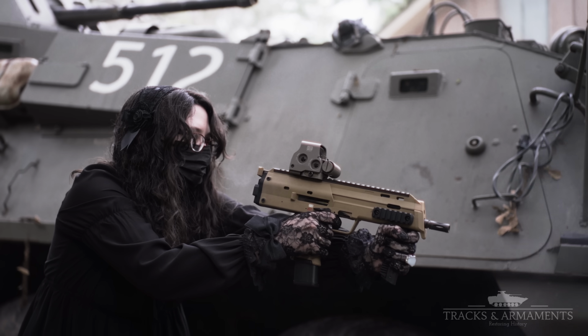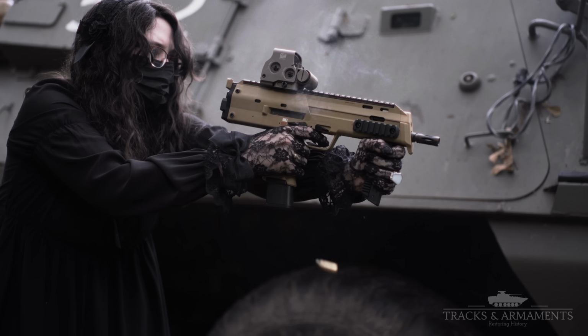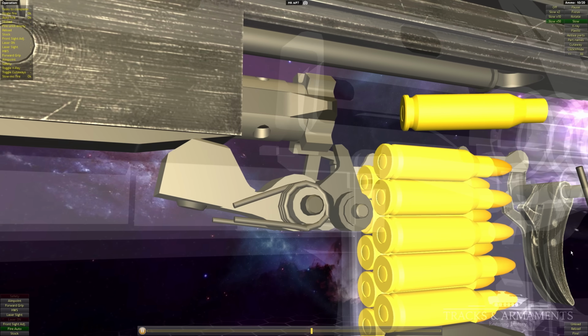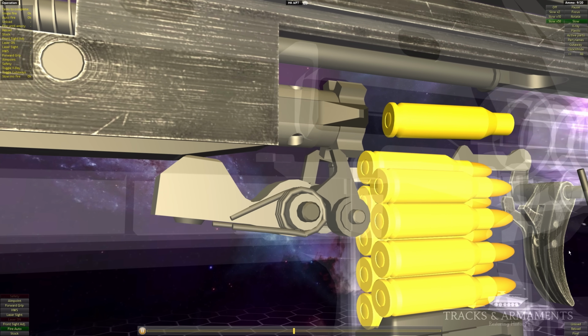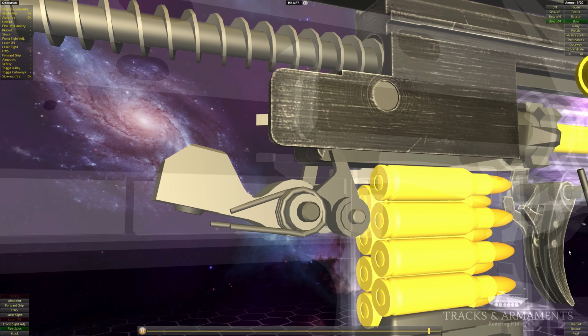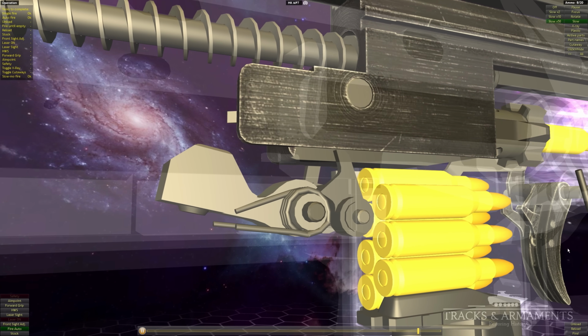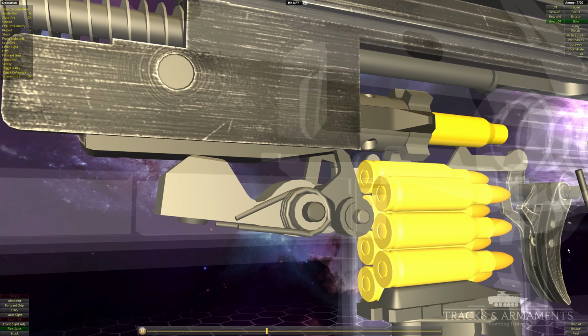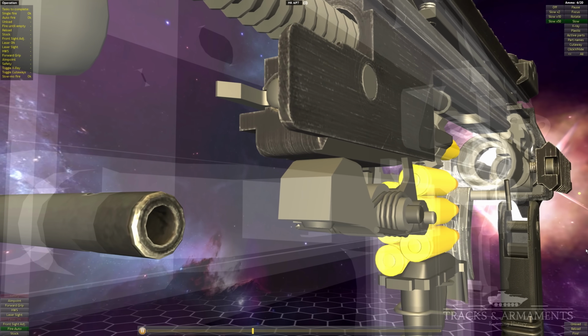We found that quick trigger release was necessary for reliable resetting. This wouldn't be an issue in select fire guns, where the safety sear would hold the hammer back, forcing a full reset before the next shot. Our speculation is that an out-of-spec part may make it more likely for dead triggers when one isn't being very deliberate with their trigger movement, but we will see what Tommy has to say.